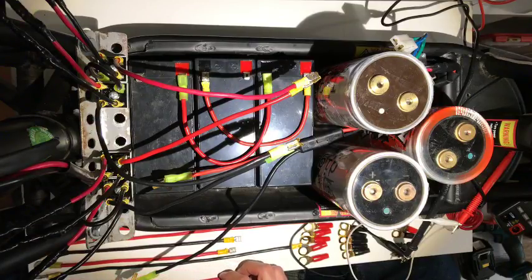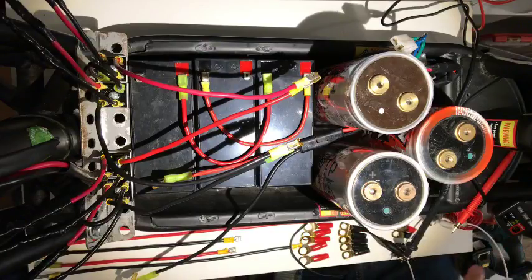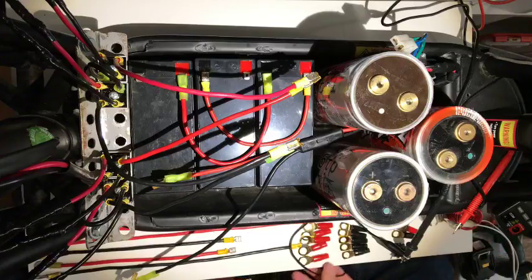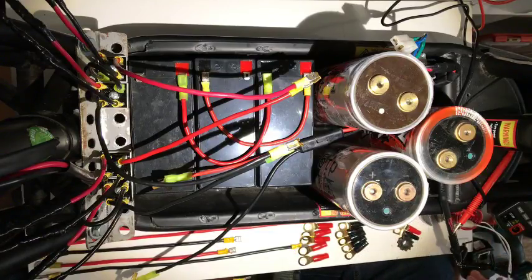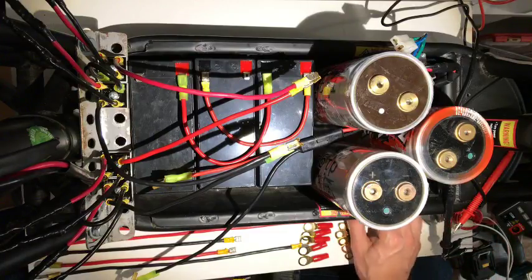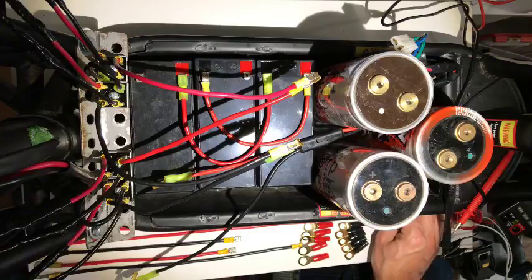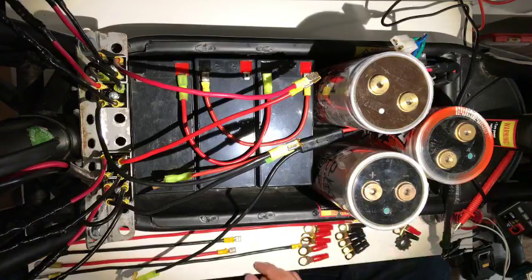We've tried it a couple times running it over voltage, and that seemed to be fine. The alternators got a little bit warm. I don't know if that's a problem, so we may have to come back down to 24 volts. But at least just to test, see if this is even going to work. If it doesn't work, I think we'll try the 24 volt. We should try 24 volts, I guess, because it does seem that the alternators kind of have a peak efficiency.